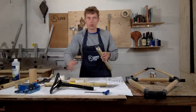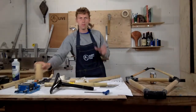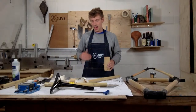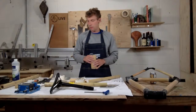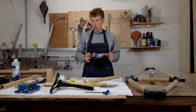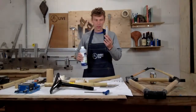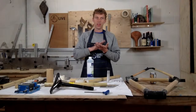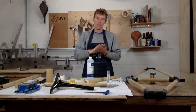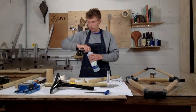The final steps I'm going to show you are how to fit and glue this safely. If you missed my metal inserts workshop, I talked about degreasing, cleaning as you go, and making sure all metal inserts are really well cleaned. So we're going to clean this — by cleaning you lift any oils, grease, or impurities from the metal, and that's going to allow the glue to bond a lot better.